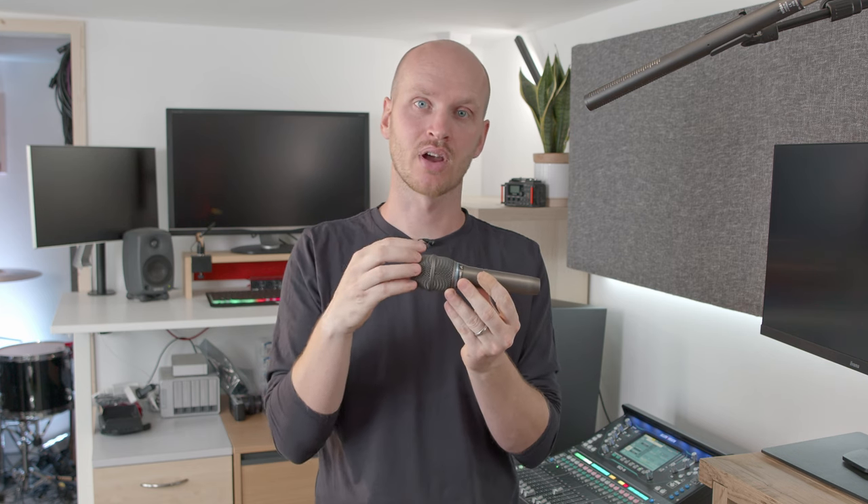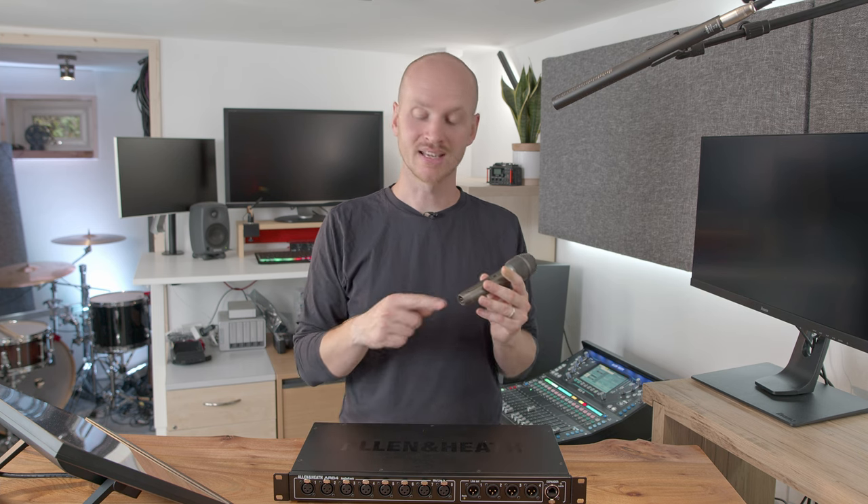The other major advantage is that we're not sending our low-voltage microphone signal a great big distance before it gets to our preamps. Out of a microphone comes a voltage — the microphone is converting sound into an electronic signal. That voltage is very, very small, and the longer the distance you send it, the more that signal is going to degrade — it's going to get smaller, reduce, and get worse. By bringing our preamps closer to our microphone, we're decreasing that distance and reducing the chance of that signal degrading.